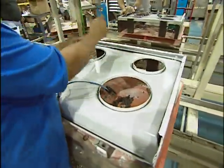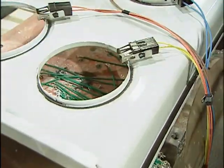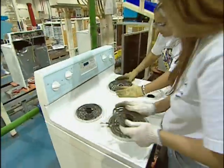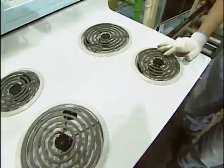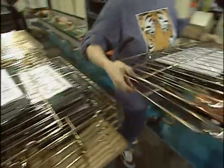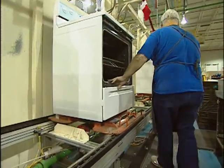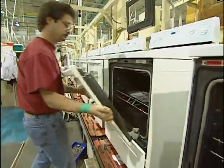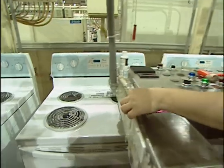The components in the range top are attached one by one. The electrical lines are run for the heating elements. The heating elements are attached as the unit moves down the line, looking more like an electric range at every stop. Now it's time for the finishing touches. The oven trays are put in, the storage drawer slides in, the oven door goes on, and there's a final check to be sure all the electrical systems are working.